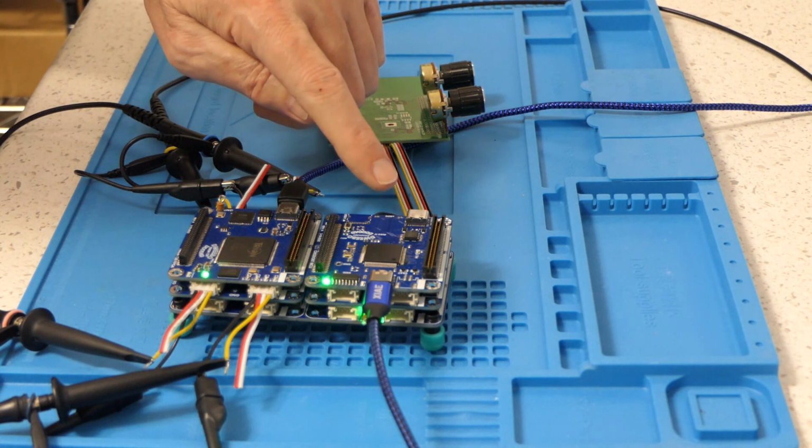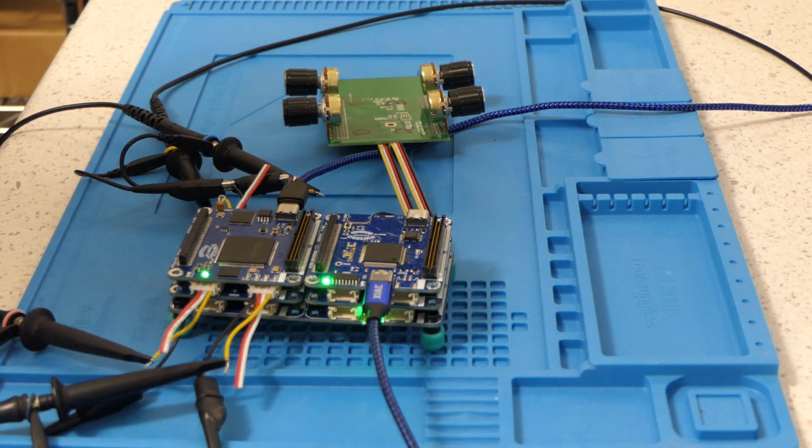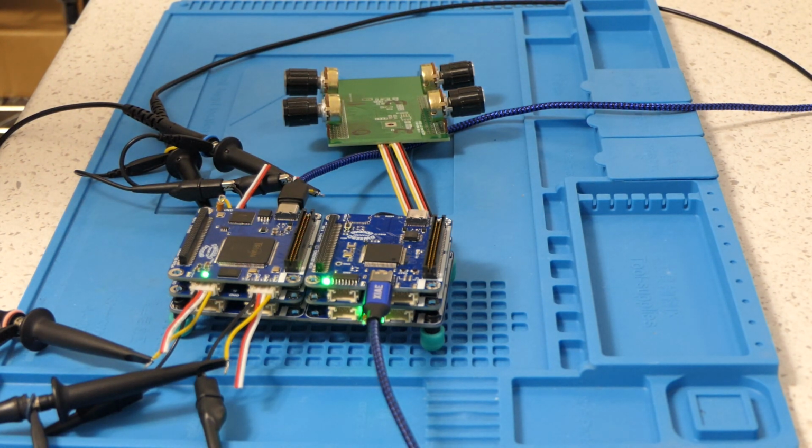The one I designed on here is a 4-bit SD card, micro SD card interface. It has a static memory controller for external memories, a video port for low resolution cameras, Ethernet, 1 gig MAC, but it has a 10 meg PHY. At least that's what it says here. I don't know. But quite a few peripherals. It has hardware floating point support as well. So not bad for under $4. I'm liking it.